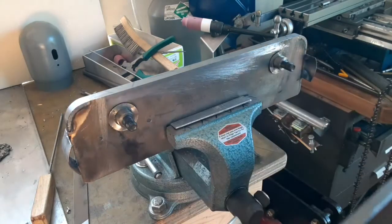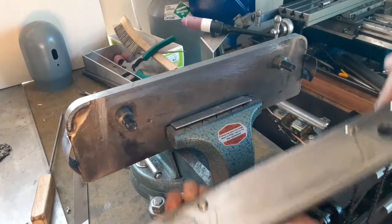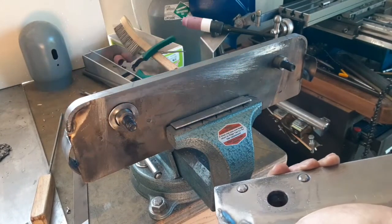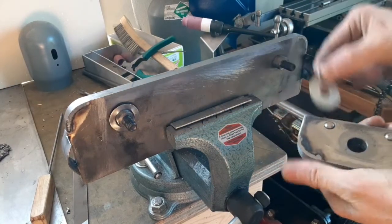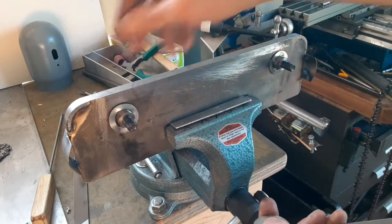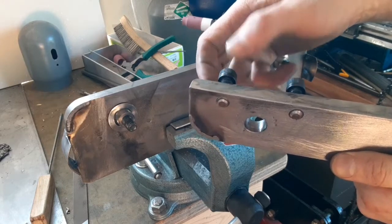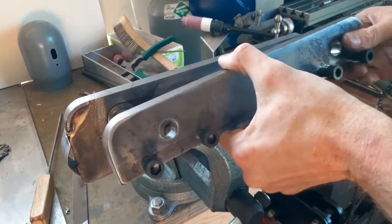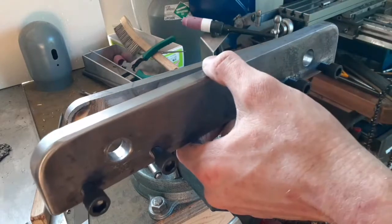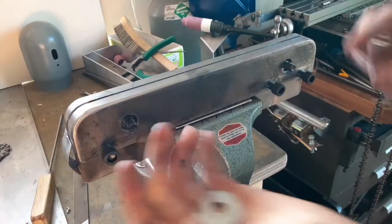Come on. So we have in here these bushings machined, and they fit really nice into these holes. And these are a variation of a Belleville washer. Maybe it is a Belleville washer. I don't know. They have the wavy pattern. That is a regular washer, Dylan. They go on like that. And then we have these effectively set screws to adjust the clamping angle. And I found the position of these is really critical to compensate for all of the undulations in the clamping bar here. So that goes together like that.